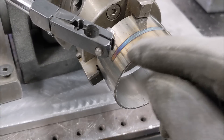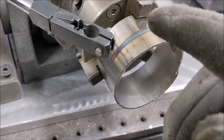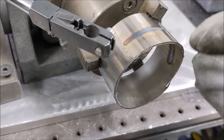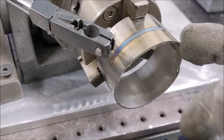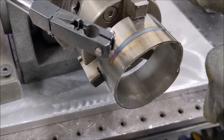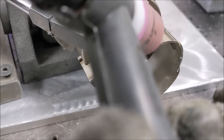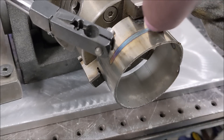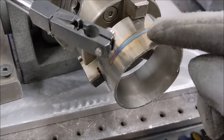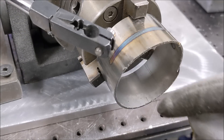I love it. It's kind of hard to tell on camera — there's no discoloration there. This is a light colored blue, not getting dark. The reason I did it with these colors is so it's more appealing for the thumbnail image so more people will click on it. The correct way to do this would be to stand your torch up more so the shielding gas covers the trailing edge better.